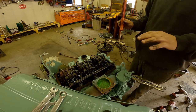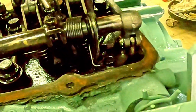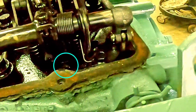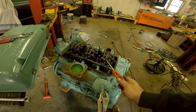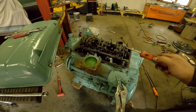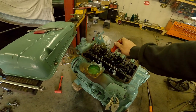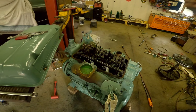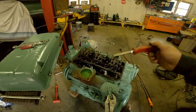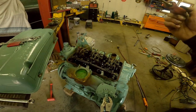The most critical part of this entire thing — and how you know you're at full fuel — is that finger. When you're holding it at full throttle, that finger should bounce. You'll feel it in the screwdriver and you can probably hear it spring back. That is how it's supposed to be. The trick to setting these racks is to make all of those spring like that equally all the way down the motor. You always start where your governor connects and work your way down. I think I did this ten times before I got the feel of it the very first time, but once you know how to do it, it gets easier and easier.